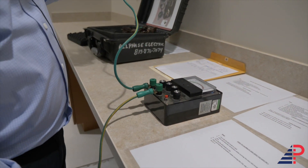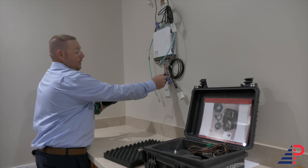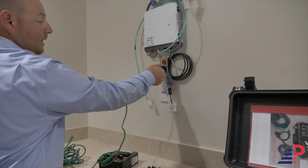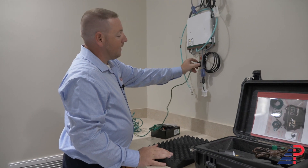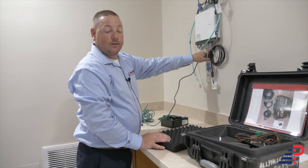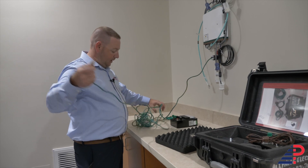You're going to take the short lead and plug it into your main outlet — a critical outlet. Make sure it's in there nice and snug, not loose. Sometimes in existing facilities the grounds are loose so when you stick them in they'll kind of hang out. Make sure you get a nice good ground. If that's not working, have somebody sit there and hold it tight until you get that nice good ground.